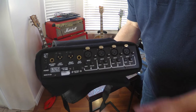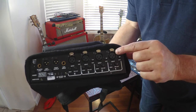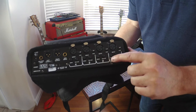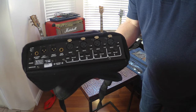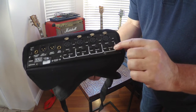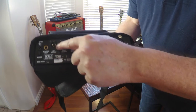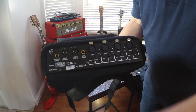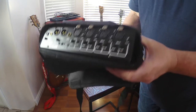Basically what we're going to do is plug in a microphone to number one. It's a condenser so we're going to run it off of phantom power, so that needs to be turned on like that. I'm not going to do the low cut because I think we can do that in post. Then we're going to have a left output that goes to the input of the recorder.